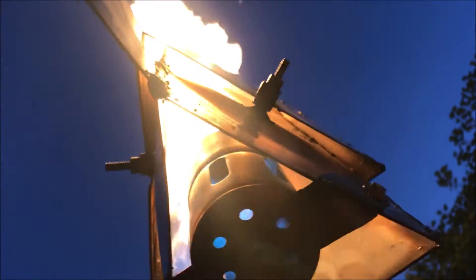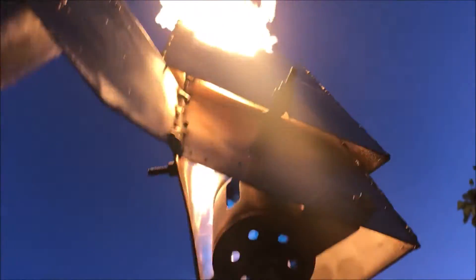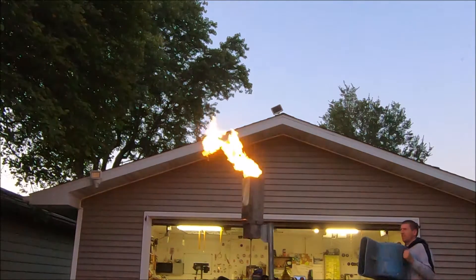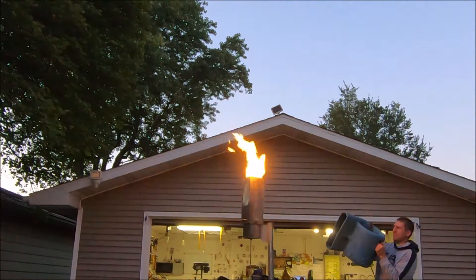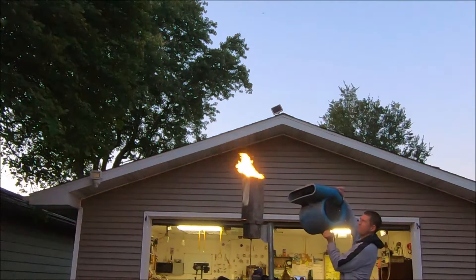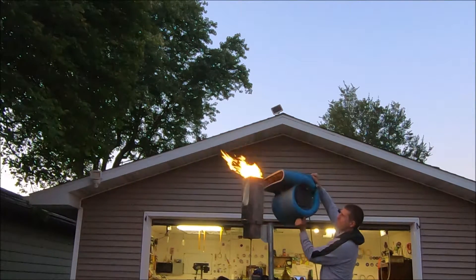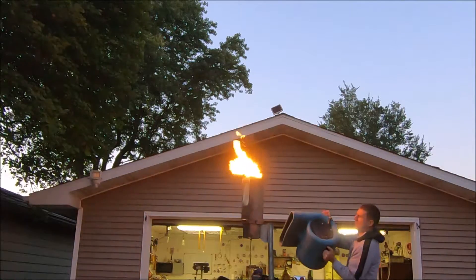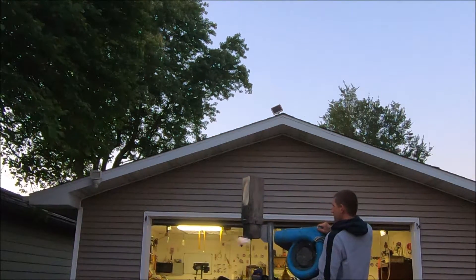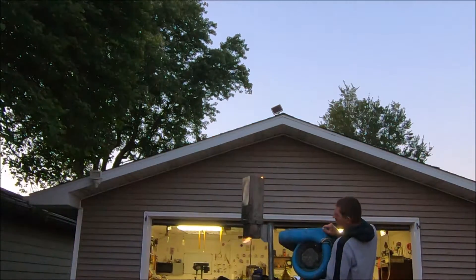One more look at that turbulence in there — that turbulence is extremely important to stability under high winds, so that's definitely a benefit. The round shape just wasn't moving air the way that I needed to. Here's another look at some wind resistance. The round shape tended to cause Venturi effects that would actually suck the flame out of the top of the burner.